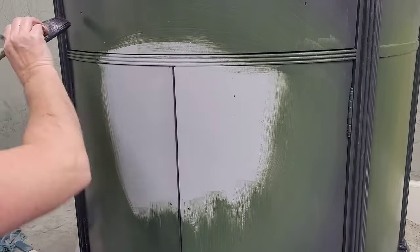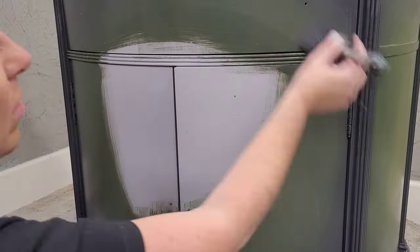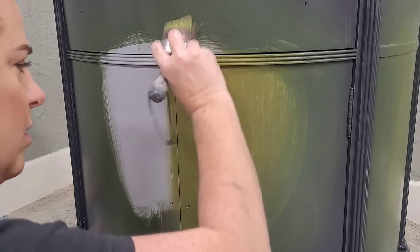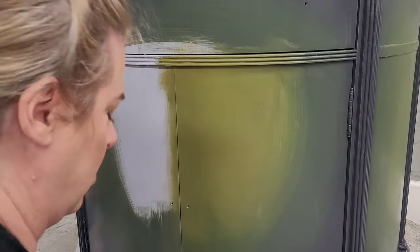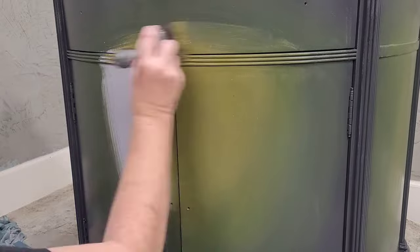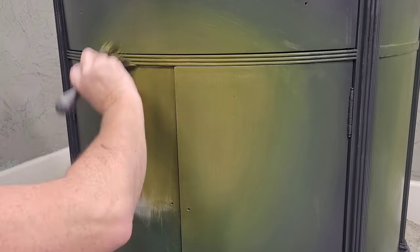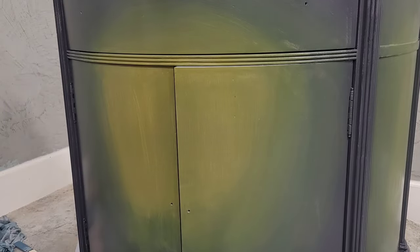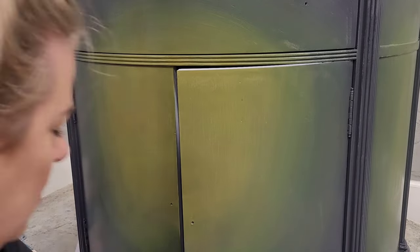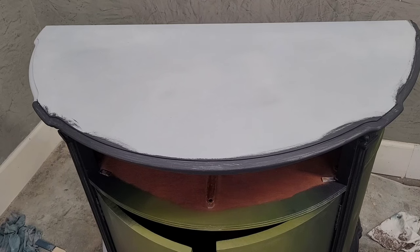I'm using my Cling On S50 brush — this is my favorite brush for laying paint on. It holds just the right amount of paint and cleans remarkably well. This is my first coat of paint, so I'm focused on getting coverage and working out my color layout. I don't worry about my blends being perfect on this coat because I'll finish that on my second coat. In the center I lay on the Spanish Olive. These are gradations of the same color — a monochromatic paint finish with various shades of green that all have yellow undertones to match the transfer.